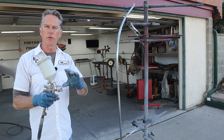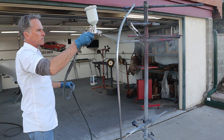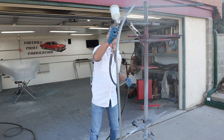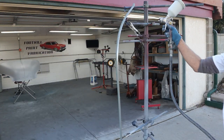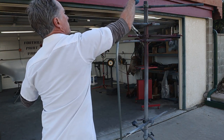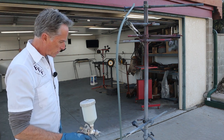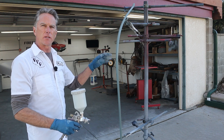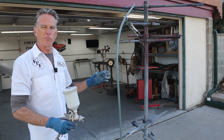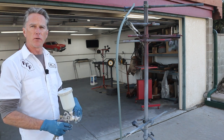I've got the air tip turned sideways so the pattern will go horizontal. Let's get this sprayed up. Somebody forgot to put masking tape on his vice grips — oh well. I'm going to let that flash off; there's a little breeze out here so this stuff will dry really quick since it's super thin. Then I'll put a couple more coats on it — probably three coats total. There's plenty left so I'm going to look around for something else that needs some etching primer to use it up. We'll let it tack off, get another coat on, and let this thing dry.